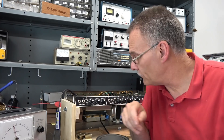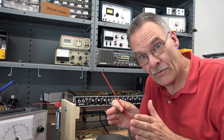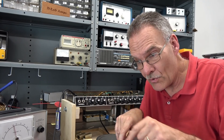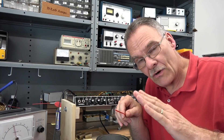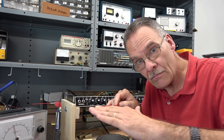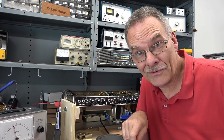Here's what I think is happening. You've got the 220 volts plate on one side of the cap. The cap is supposed to block DC, and the signal is on the other side. I think that the cap has some strange leakage — it's going nuts right now. I believe that it's charging and then goes into an oscillation, then the cap kind of recovers, discharges, holds, and repeats. So it's probably just internal leakage. After all, it's a 60-year-old cap.